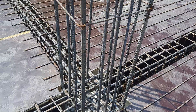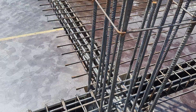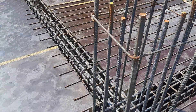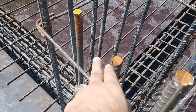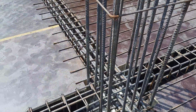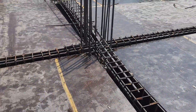You can see this column, which is 24 by 24 inches with concrete cover. In the steel reinforcement here we have 12 numbers of steel rods. You can see 25 mm eight number bars, and also 16 mm and 20 mm bars. They used 60-grade steel rods in this construction.